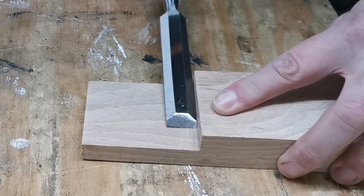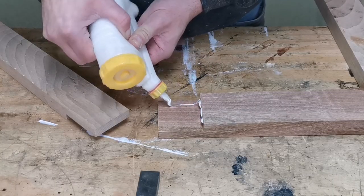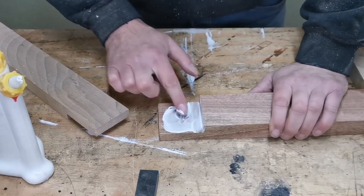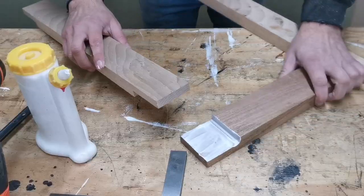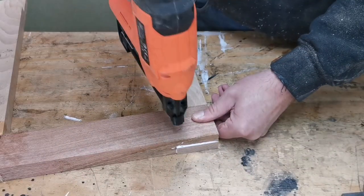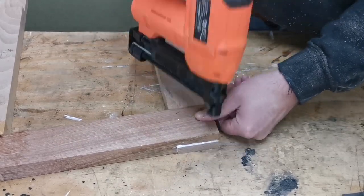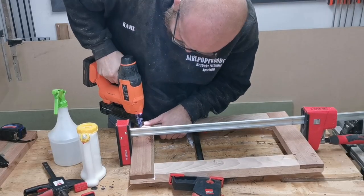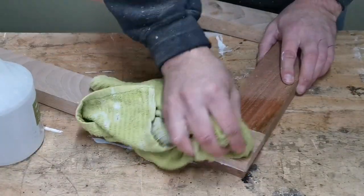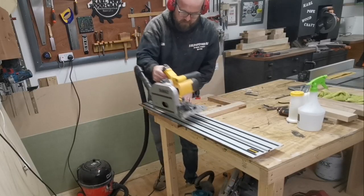Next we do a little bit of cleanup with a chisel, preparing the joints for gluing up. We're using standard PVA wood glue and then we press the joints together, making sure everything is square, and then we fire a few brads in. I'm doing this because I need to get on with the project — we could just clamp and leave overnight, but I've only got a day or so left before the challenge deadline. I then wipe off any excess glue, get the track saw out and square up the ends, removing any overhanging tenons.